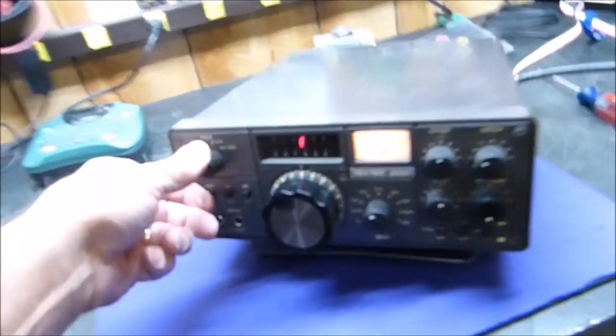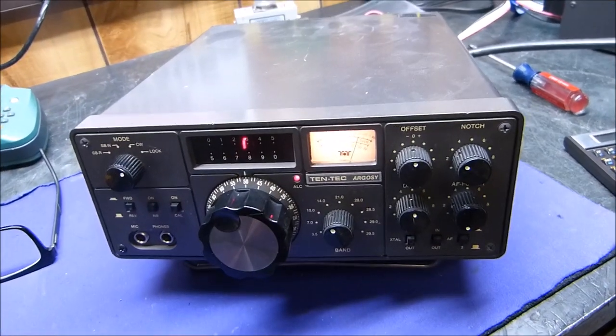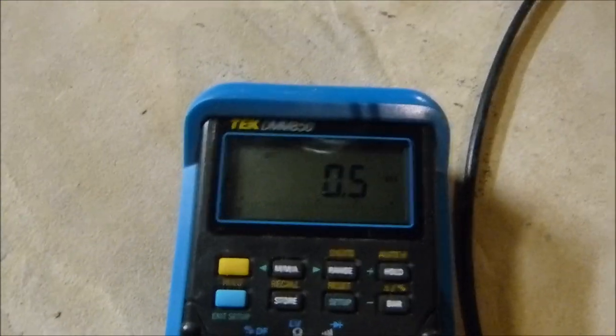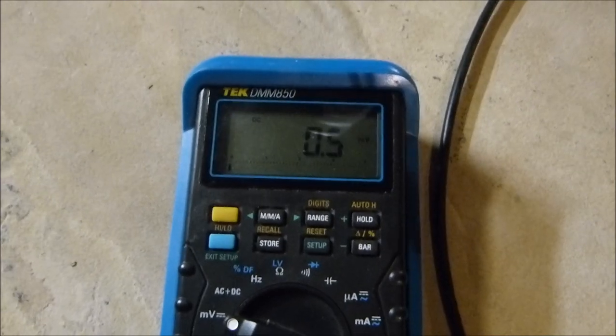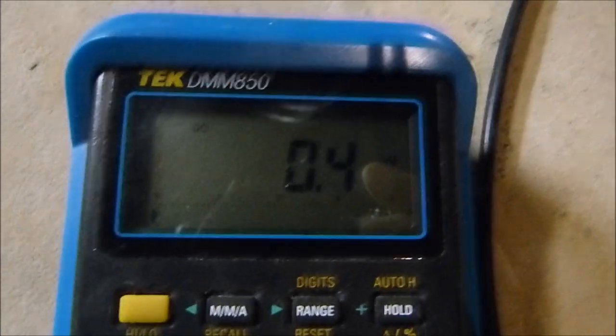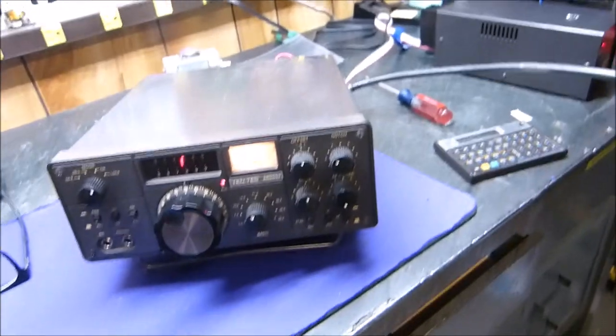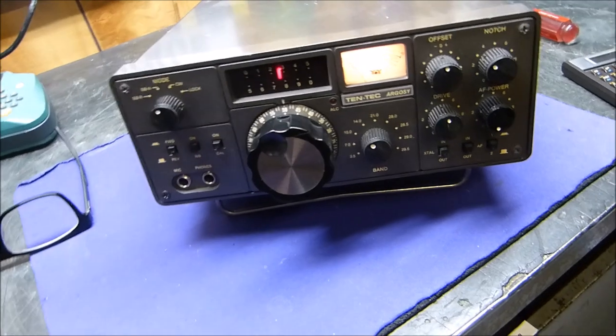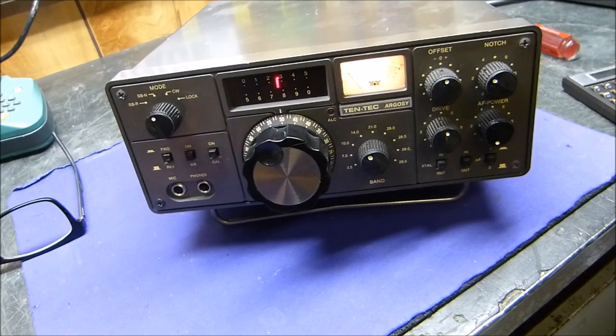Now I've got the little store-bought choke in here. Remember we had 47 units before — look at this! Our common mode current went way down and our power went way up. We solved a lot of problems. It's basically zero — if you remember, that's our zero point. It eliminated it. And our SWR went down so low the unit's not kicking offline. It worked.